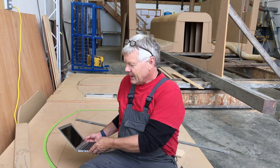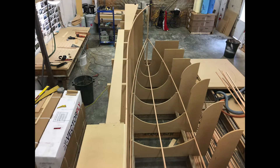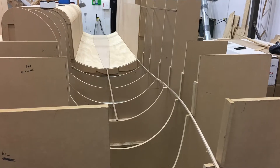I'm at the stations that are forward of our fixed stations, so we're working on the front half of the boat, and we have the challenge now. Everything is coming together — the hull sides are coming together into the bow. We have two hulls. We have the keel coming up and wrapping up into the bow stem. We have the chine and the chine flat. The chine is coming around and wrapping into the lower bow. The chine flat is growing and then shrinking. The hull bottom is getting a little bit sharper and a little bit sharper as we get closer.